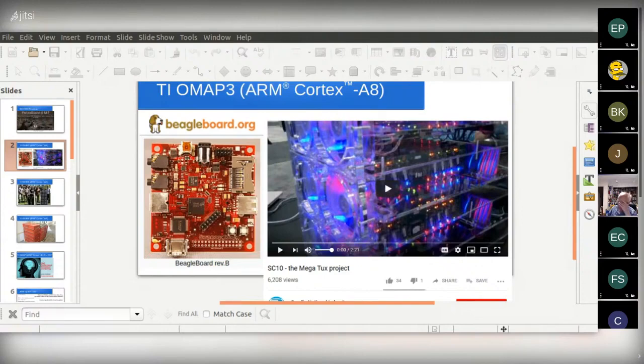When I got a couple of these drawers from Sandia, I put Ubuntu on the SD card — one SD card per Gumstick. Surprisingly, as long as I got big enough micro SD cards, I could update that well into late Ubuntu years, probably up to something from 2018. Then I couldn't find a way to support the OMAP-3 after that, not on Gumsticks anyway.